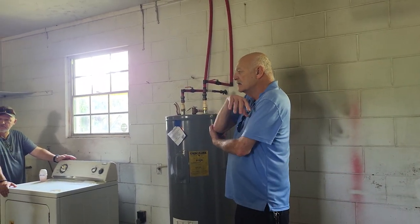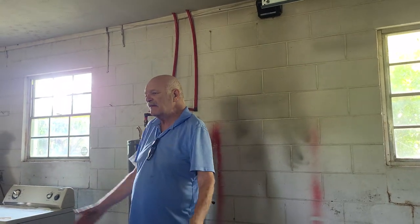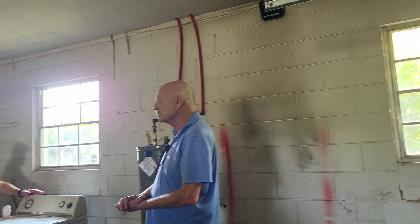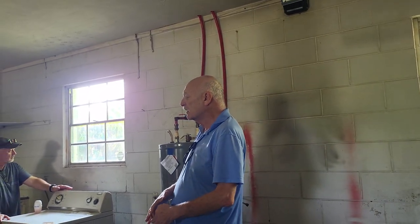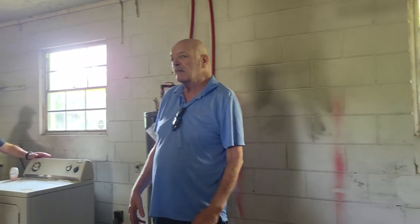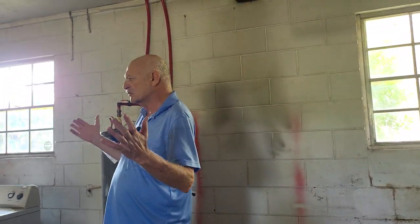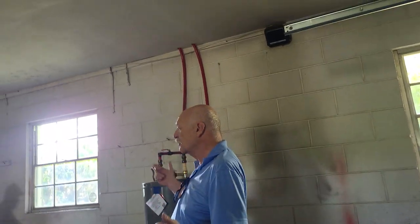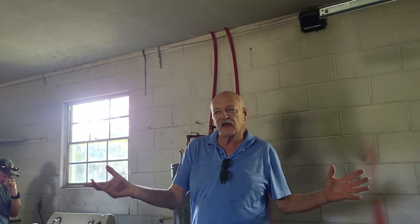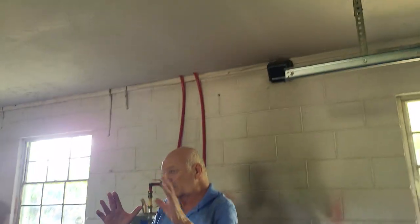If you're rehabbing and changing something, don't leave it illegal. My advice: anything that requires a permit — if you don't do it, there's no statute of limitations. They can come back years later. And an end buyer's inspector is going to find it anyway. Say you did some electrical work without a permit and nobody sees it, but then somebody gets electrocuted down the road — they'll find out there was no permit. You're going to get caught. Anything on the exterior requires permits: windows, siding, doors, roof, soffits. In Florida you have to submit product specs before you can get a building permit.